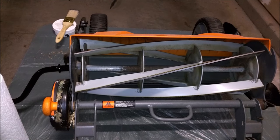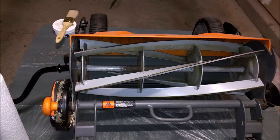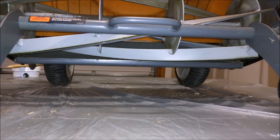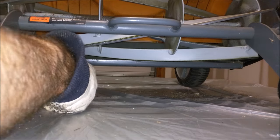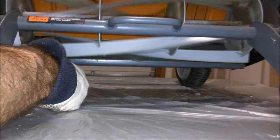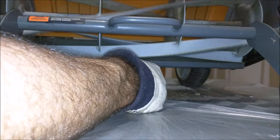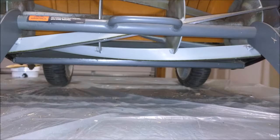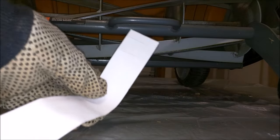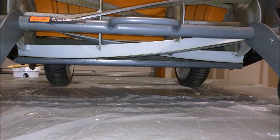Now make sure that you can cut paper and that it's cutting properly before putting the chain back on, the sprocket, the cover, and the handle back on. That way if you need to make adjustments you can do it now. I'll test cutting from the left, the center, and the right with each one of the five blades. Take some strips of paper, put it down here, and move clockwise — be very careful with your fingers. You can see it's not cutting. We'll try the middle — not quite cutting there either. We'll test over here — that also touches but does not cut. So we're going to need to make some adjustments with the blade and move it down.